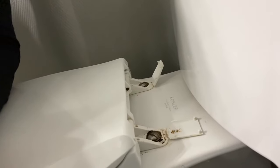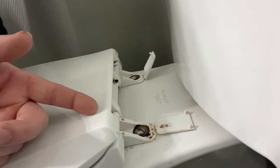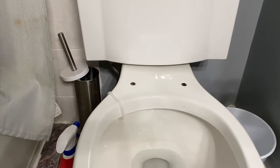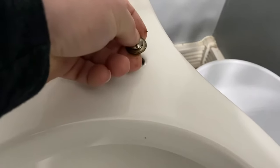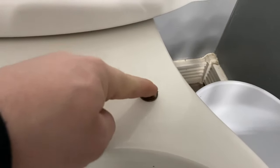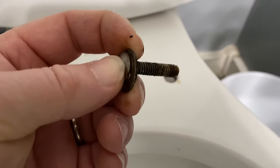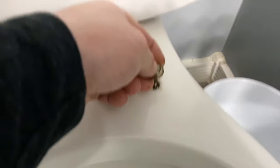So let's take the toilet seat off and I'll show you how to permanently fix it. I flipped up those two little plastic pieces — it's just a little plastic through bolt, and on this toilet it's actually a metal screw. Now that I've got the seat removed, I want to show you what the actual problem is. This is the hardware that comes with it, and if you put that in the hole it actually slides around — the hole in the porcelain is too big for the hardware. So you need to get some type of spacer in there that fills up that whole gap.